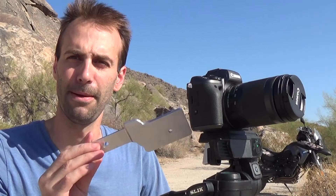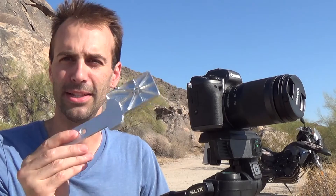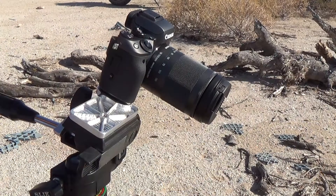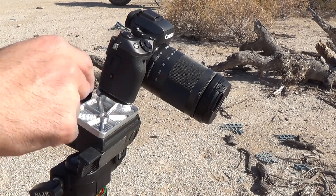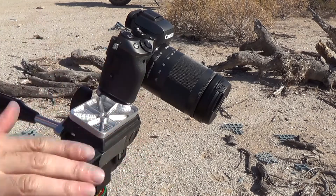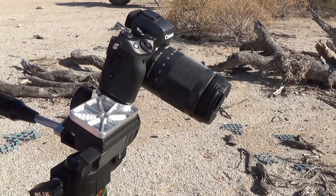I really wanted to talk in depth about how I designed this offset bracket. I made my own because the solutions on the web are sort of terrible. From this view you can see that it fits my tripod almost fully to take advantage of the most contact area I can, and what these webs do is maintain strength while allowing you to remove most of the material.